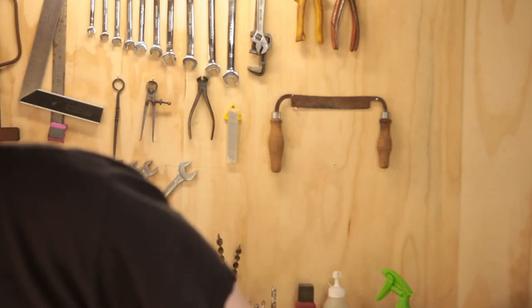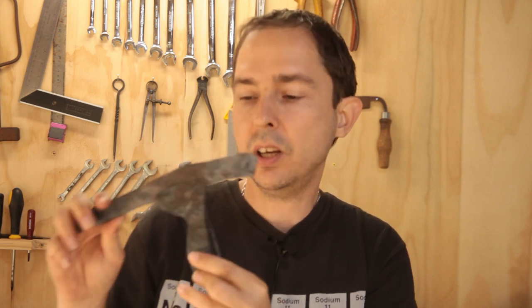So yesterday we got the kitchen axe to the rough forged stage. The blade bit is welded in, the body of the axe is more or less shaped, it's got to be evened out, there's a significant amount of twist. We have to draw down the edge yet and hope it fits in the forge throughout this because it's pushing the limits on what we can fit in diagonally.